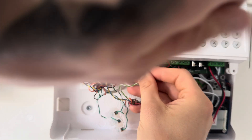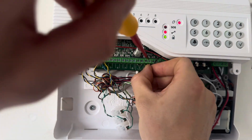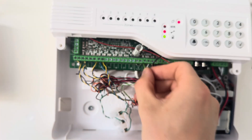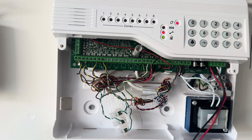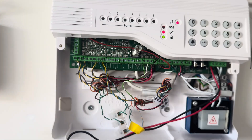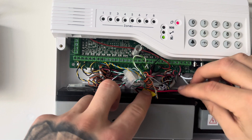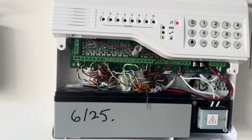If you've got nothing else in the tamper circuit, this will go in as shown. If you have got other things, you need to add them in a daisy chain - I'll add a video in the description where I wire a Veritas 8 alarm system and do an in-depth demonstration on how to wire a daisy chain for a tamper, so it might be worth watching that once you've got all your devices in the tamper circuit.